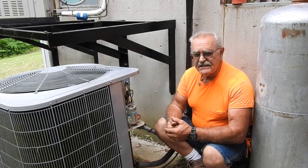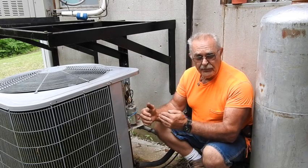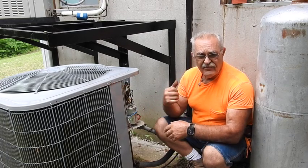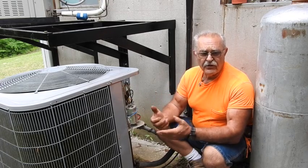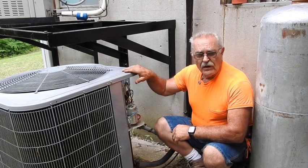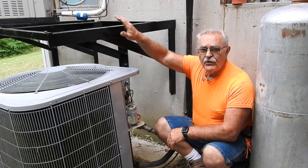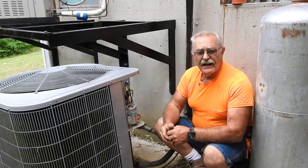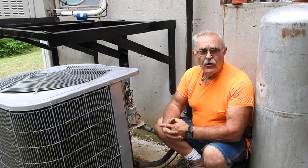The charge that's actually in the existing system. Then we're just going to have a little bit of vapor trapped in the suction line, the liquid line, and the evaporator that we're going to have to recover with the recovery machine. Once this is out of the way, I'll back the old truck up and we're going to set the new unit right up here on top, then go about the business of reusing the same freon lines because the new unit is also R410A.